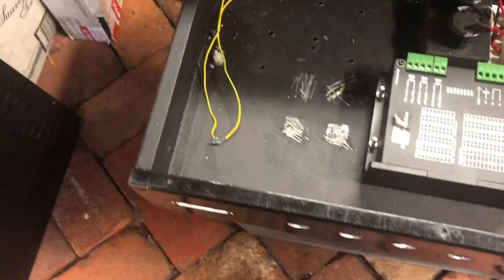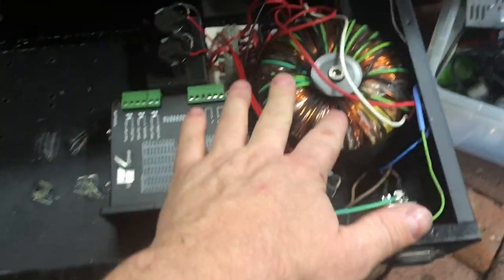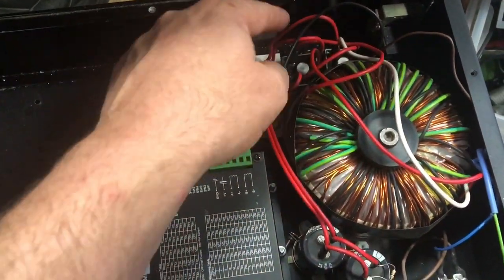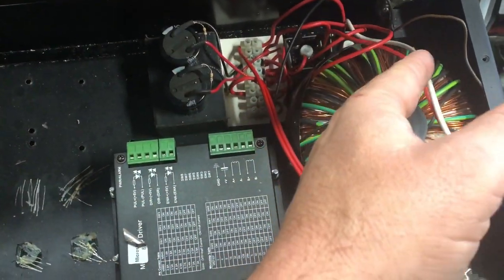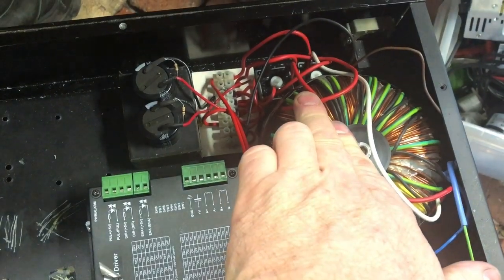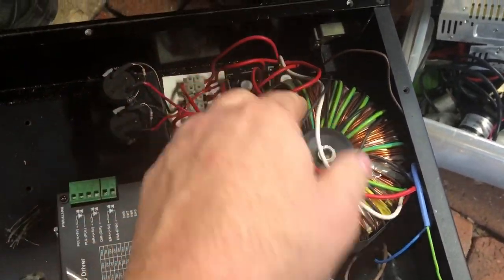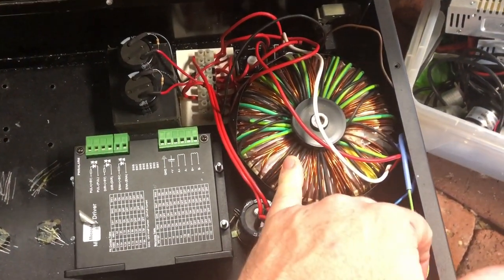Now I've isolated what's in the control box down to 240 volts in. There's a coil. There are two rectifiers, which means I've got one tapped pair going between red and black and red on this rectifier. And then the other rectifier, I've got black and white.